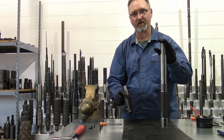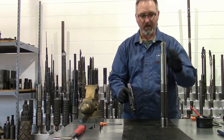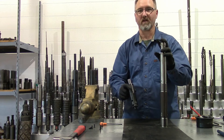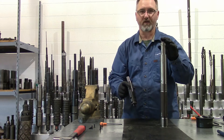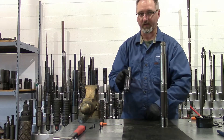It comes with a variation of different size weight bars for different applications. Typically the 18-inch weight bar is probably good enough for most applications of slickline up to 125 size. We also offer a 36-inch and a 5-foot weight bar. I'll take this apart and show you the inner workings of it.